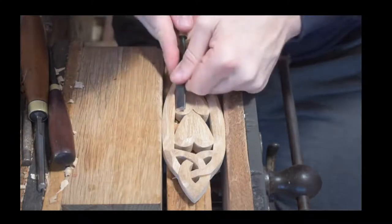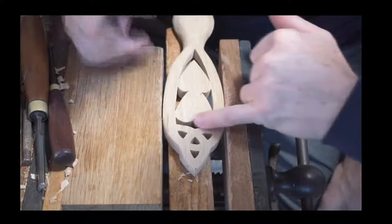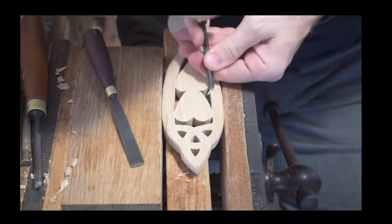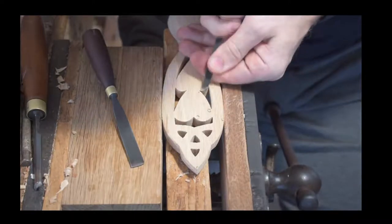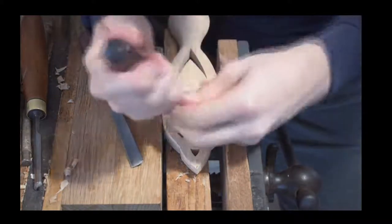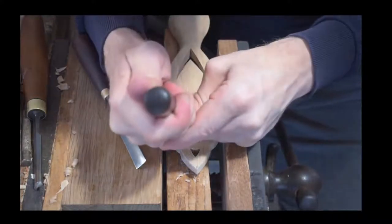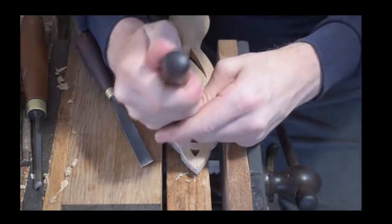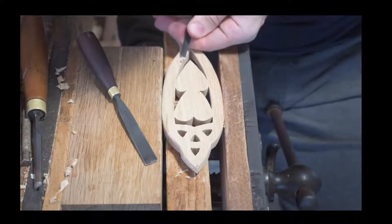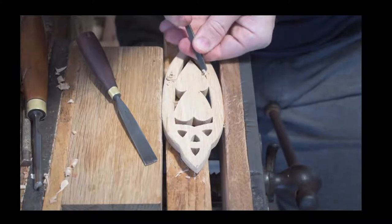Let's turn it over and check the back. That's not too bad, but it's quite sharp. I like to soften the back a little bit. All Dad likes to do is just soften those edges. Look at that — that's just where the grain has gone the other way, so I'm going to carve towards myself, which I know you shouldn't do, but that particular piece the direction of grain is going the opposite way. We just take the sharp edge off there. That softens the back — when I'm shellacking it now I'll be smiling.